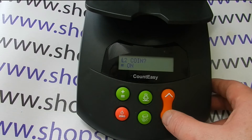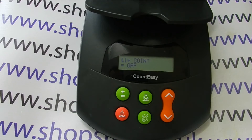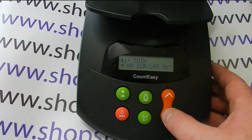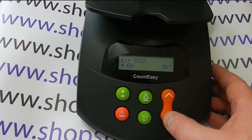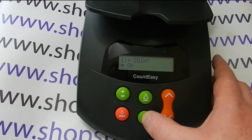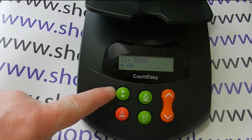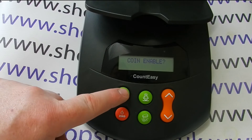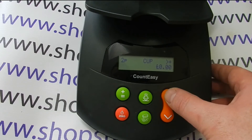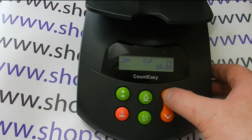The different coins set up on the machine until you find the pound coin with the asterisk, which is the settings for the new one pound coin. To enter and change it, you press the note and coin button, then toggle through until it's set to 'On', and then press the note and coin button to save. You then press plus/minus twice to escape back to the main menu.